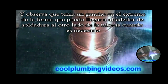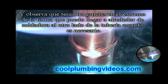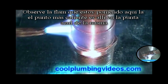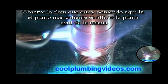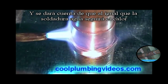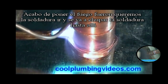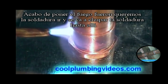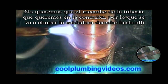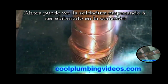You'll notice I had a hook on the end of the solder — that's so I can reach around the other side of the pipe when I need to. Notice the flame I'm putting on here: the hottest point is right there at the blue tip. The solder, just like water, will follow the heat, so we just put the fire where we want the solder to go and it will suck the solder right up in there. Now you can see the solder starting to be drawn up into the fitting.